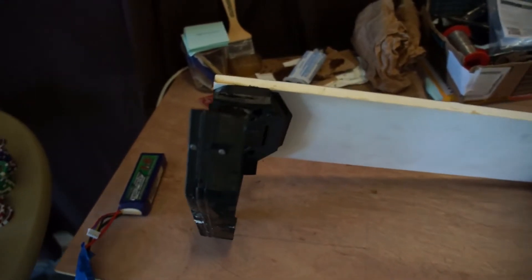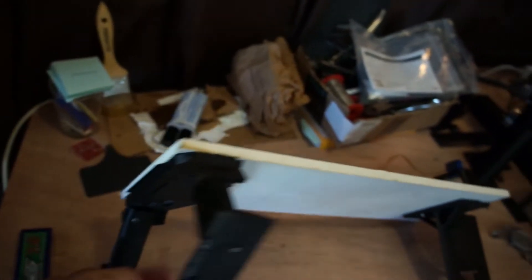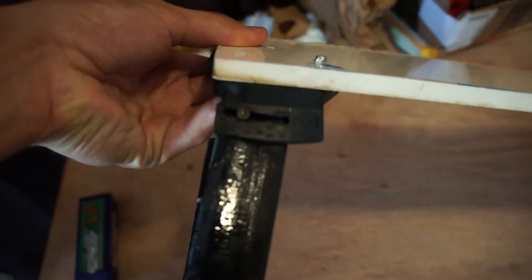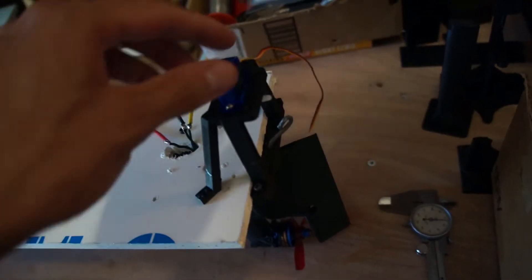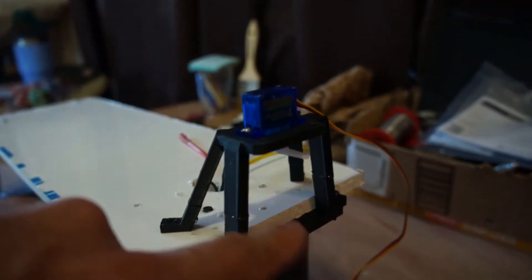Wanted to give a quick update on the physical board. We got the front wing completed yesterday and it's pretty sweet. We've got the stringers underneath and our adjustable angle mount - it's at a pretty high angle of attack right now but we'll adjust that later with some washers. Over here we've got the rudder, the motor, the mast cap that just came off the 3D printer, and the rudder servo with a little horn that's going to attach to the rudder pin via zip tie. It's coming right along! Taking the boat out tomorrow - I am so excited, this is going to be amazing!